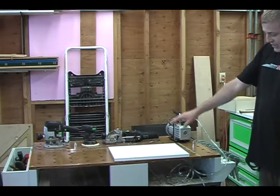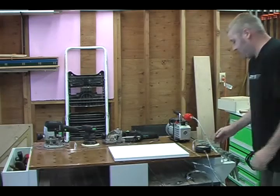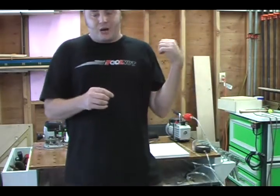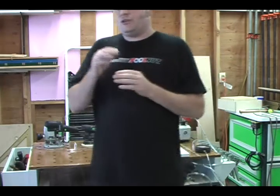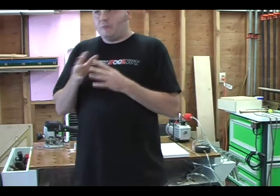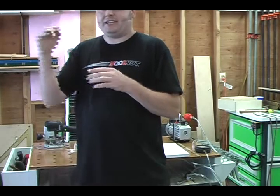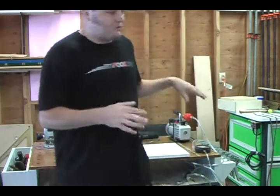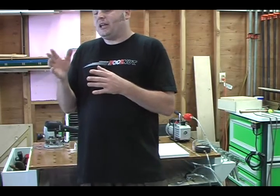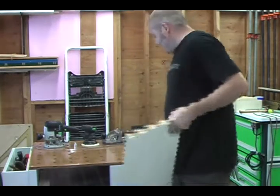It's still raising up. This gauge right here is going to tell us what we're working with. Now, if you take the gauge and hook it to the hose and run it out of that vacuum pump, 28 inches of mercury is the most you can get. There's a little pin and the dial comes up and hits that pin. That is the most output that this model right here can give you. Now what that's going to translate to is a 2-to-1 ratio. That's about 14 psi. So you're getting 14 psi out of this little hole.